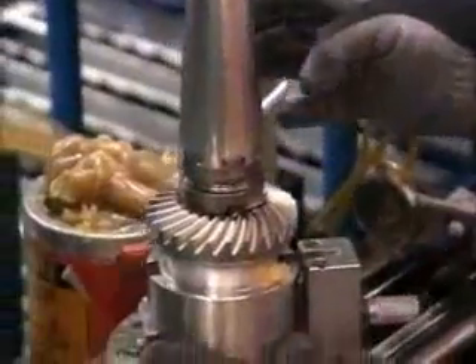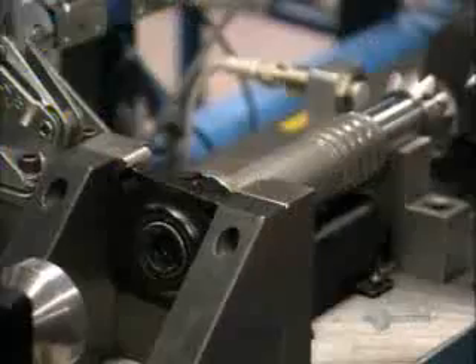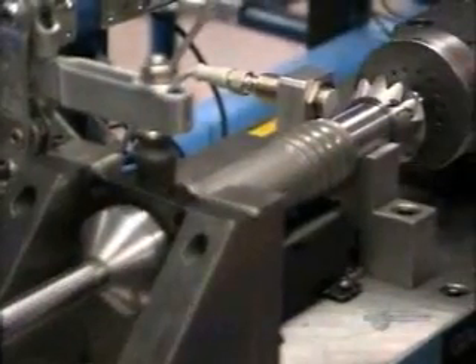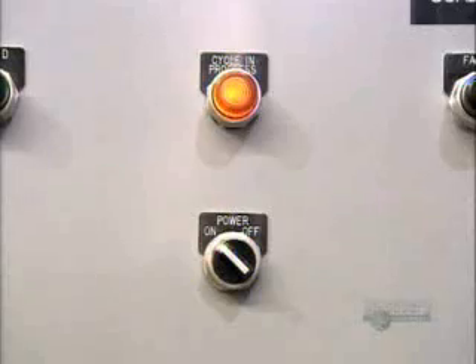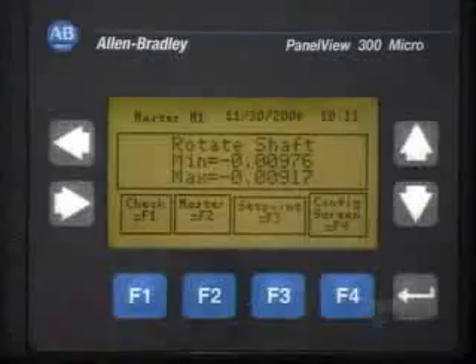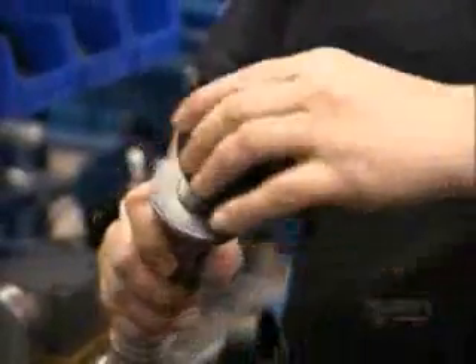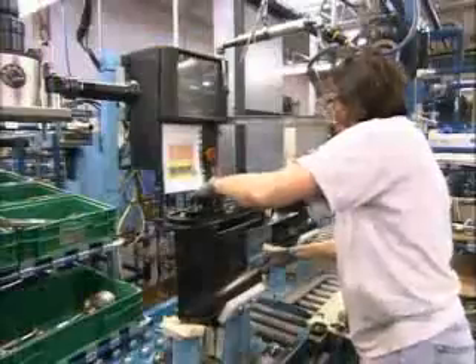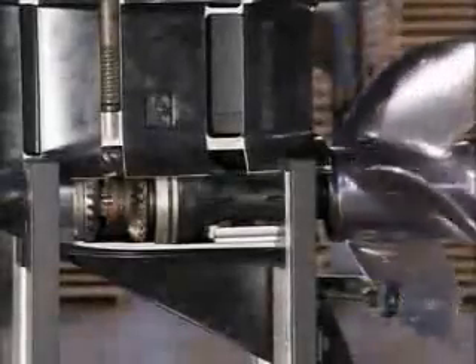Meanwhile, on another assembly line, the gear case takes shape. A machine locks the case's forward gear to a shaft that'll turn the motor's propeller. The propeller shaft connects to the lower drive shaft. The factory buys it ready-made from a supplier but still refines the dimensions so everything fits together perfectly. A machine analyzes the shaft and concludes this one needs to be 0.25 millimeters longer, so workers add the required number of steel discs, called shims. They insert this shimmed lower drive shaft into the gear case, then insert the propeller shaft with the forward gear. Now the gear case is linked to the drive shaft, which connects to the propeller shaft, which turns the propeller.